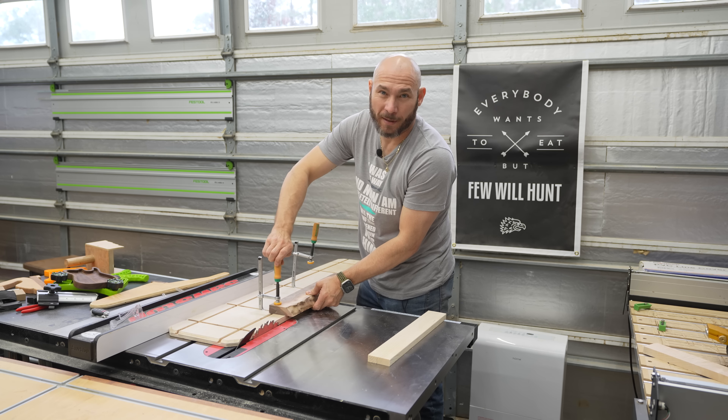Take out that dovetail bit and put in a chamfer or roundover bit if you want to soften these edges up. If not, you can just take sandpaper and hit the edge to knock that sharp edge off — but only do three sides. You're gonna do the two short sides and one long side. One long side you're gonna leave at a sharp 90-degree angle on purpose. Now take your sander, 120 grit, and sand the whole thing front, back, and upside down. Then throw on some wax — my preference is Outlaw's Board Butter — especially on the bottom to help it slide on your table saw much easier.